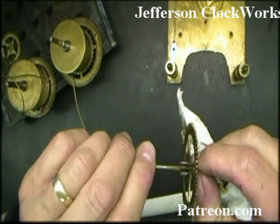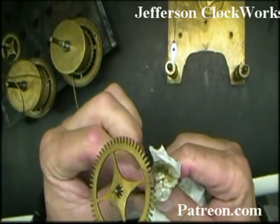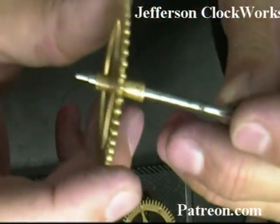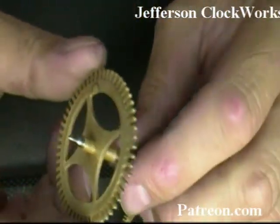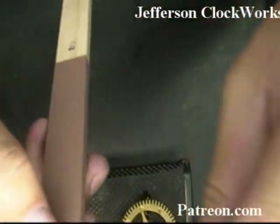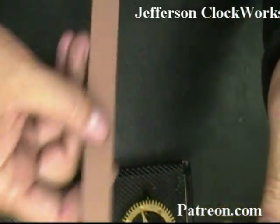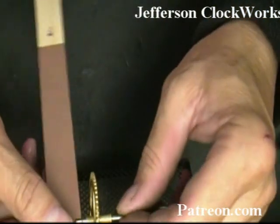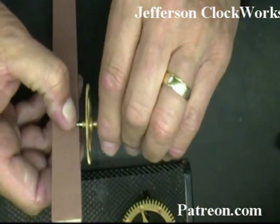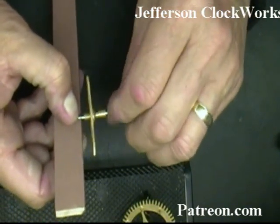Feel some grooves on that — this pivot has to be resurfaced. Gets most of the grime right off of the wheels and they look pretty good. The next thing you can take all of the wheels and just simply put them in a lathe, or you can do it by hand if you want. Just get a polishing stick that you can buy at Merit's or Time Savers and polish them up a little bit. In a lathe that goes a lot faster.